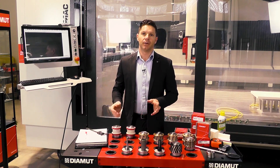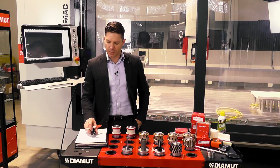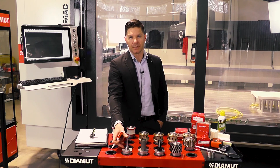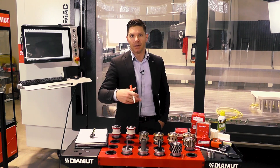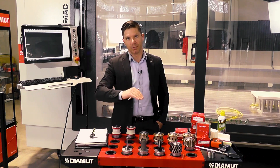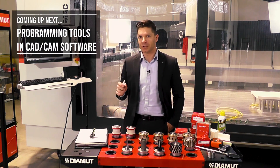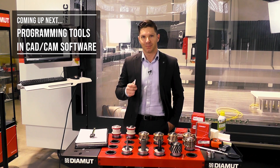Now we have all the data to move on to the next stage. For our blind hole drill, the removal rate is going to be the depth we set in our programming — so the overall height is what we want. Same for the core bit — we want the total height, with depth set by the program. For the finger bit and power edge, we're going to do a little offset so those tools go below the material as we're running. For our profile sets, we're going to create a footprint and adjust it on the go. The next step is putting that information into the PC so we can do our programming. We'll be utilizing iCam. If you have any questions, please feel free to contact us.